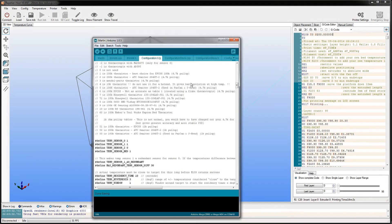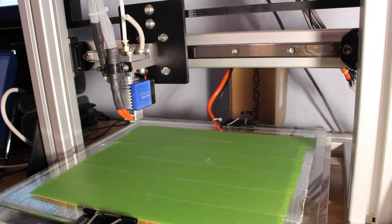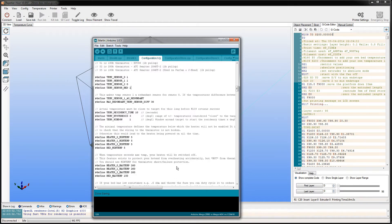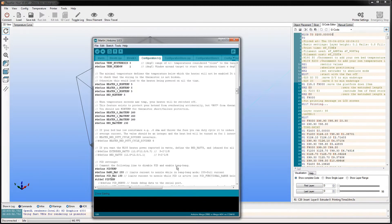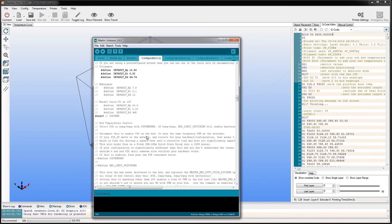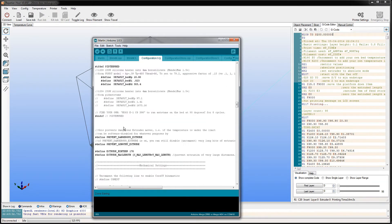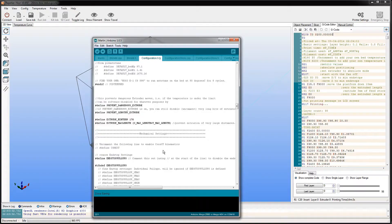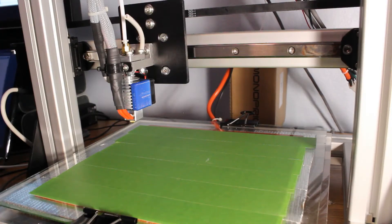Okay, so I'm back up and running. I've got Repetier Host open again - we're going to try to heat up the bed. I've got this temp sensor bed defined here. Pretty much the same stuff here in Marlin that we did on the hot end - minimum temp, maximum temp, stuff like that. Here's the PID constants for that as well. I'm going to set it to the Azteq again and get ready to try to print with the bed at about 60 degrees.